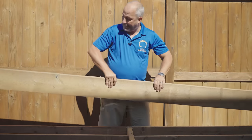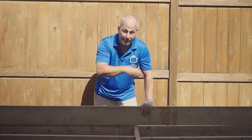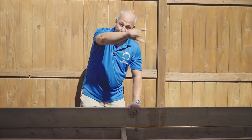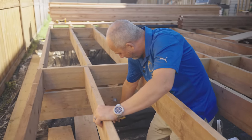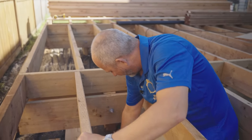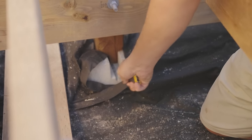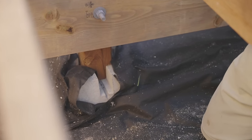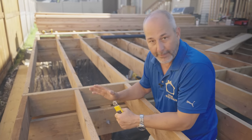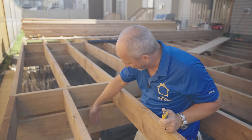This is actually a pretty straight piece of wood and I'm still an inch short. So because I'm an inch short, I'm going to use just a sliver off of one of my deck boards. I know already that because I'm going to use a nosing across the front, I'm going to have a bit of trimming to cut off here. What we have here is a concrete post that has a one and a half inch gap. So if we can lift this post, we can slide a shim in underneath. Since we're an inch short, we're going to add a one inch shim right here and use a little bit of leverage. Because we have a box beam, anytime you can grab a 2x4 or a 2x6, a couple of guys can lift it up and have someone slide in the shim. No big deal.